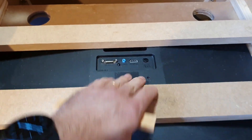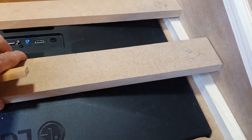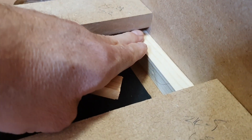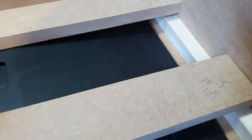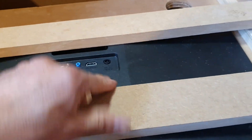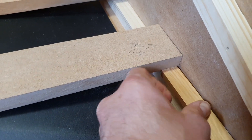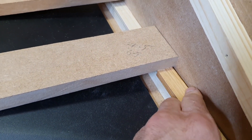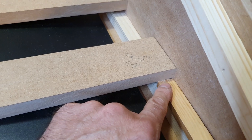They're reasonably thick pieces of plastic and there is a little bit of give. I've measured these gaps — there's a gap here and a gap here — this one is 6.5mm and this one is 7.2mm. The casing actually goes up a little bit, and I need to get some blocks of wood. This one is going to go in here but it's a bit too thick at the moment, so I'm going to plane them down, glue them in place, and then screw these supports in through these. That should hold it and be removable as well.